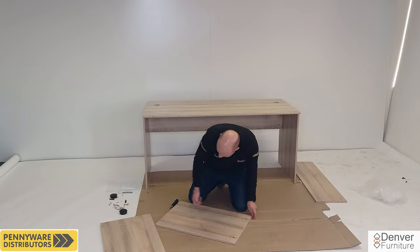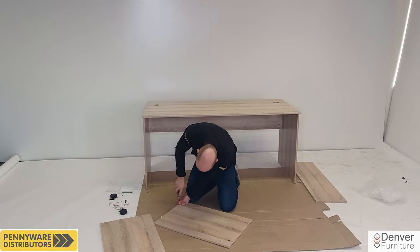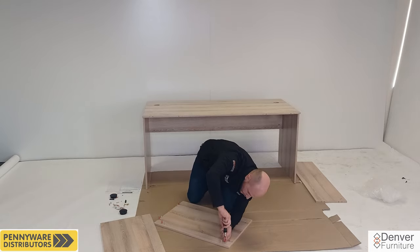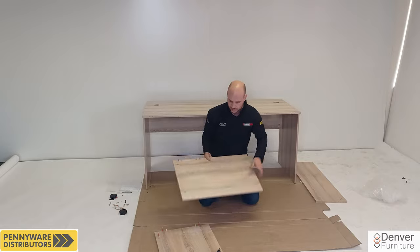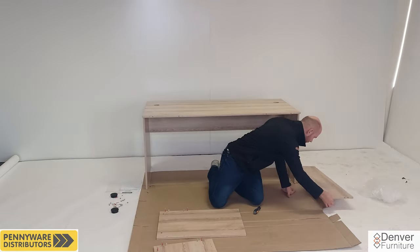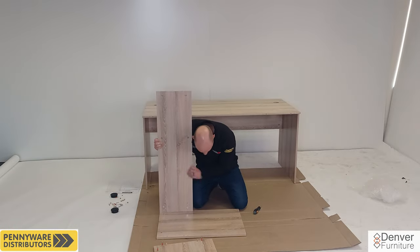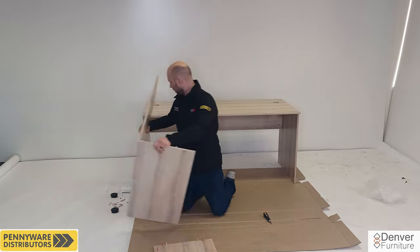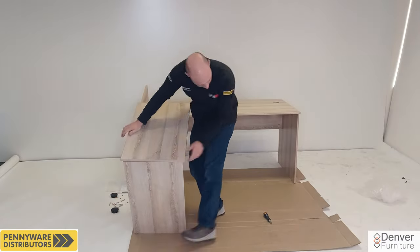The next panel is the side top panel. Pay close attention to step two in the left side mounting section. Insert the cams and only insert four dowels and four steel pins as illustrated. Set small top panel aside. Gather the side foot panel and lay it on the flat surface. Also gather the side back panel — the short panel we did at the very beginning with the six cams inserted. Lower the side panel onto the side foot and only lock the two cams closest to the side foot. Turn the small assembly over as shown. Lower the side top panel onto the small assembly and lock all the cams underneath.